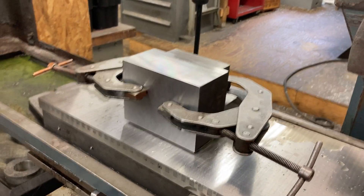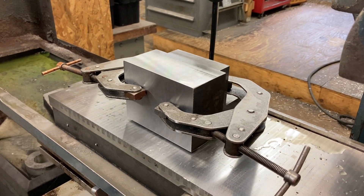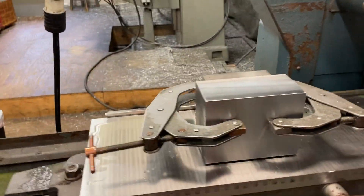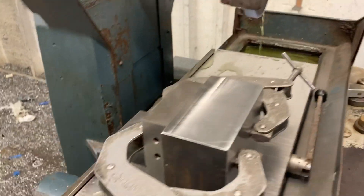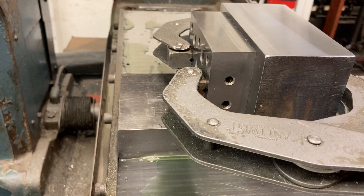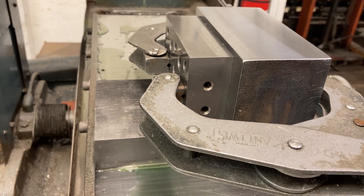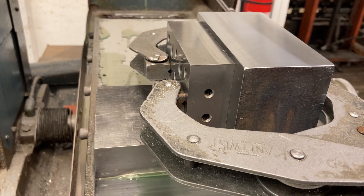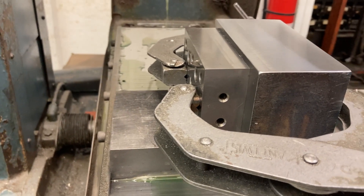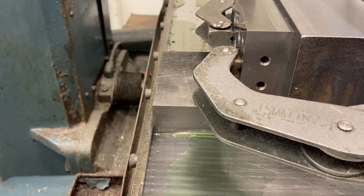I don't have one of those fancy grinding fixtures that use a squaring block — Herman Schmidt makes one, they're expensive. This is what we got. We have a nice angle plate back there, a knee, whatever you want to call it. It looks like a Suburban Tool but I can't be certain — it came with the equipment. It's a nice ground knee angle block.